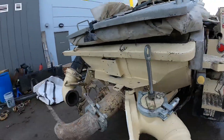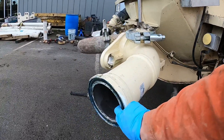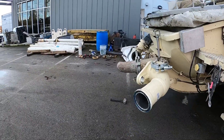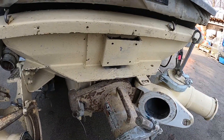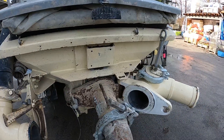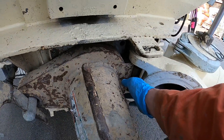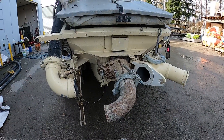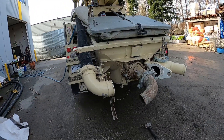If you want to come off the passenger side, because we've got the swing gate bungee-corded out of the way, it comes out far enough to get past that. We have used this piece for boom work in a pinch, as high as 25 stories. I wouldn't say it's ideal — there's a lot of flex that takes place on this swing gate pin, so I couldn't recommend it for that regularly.